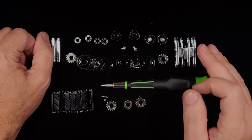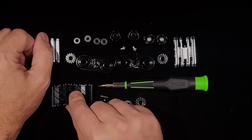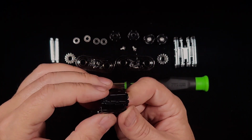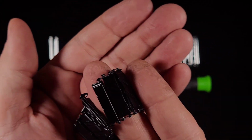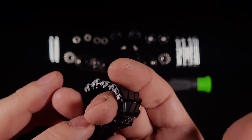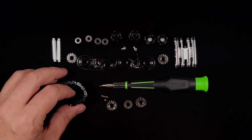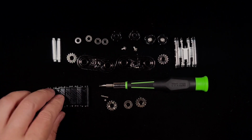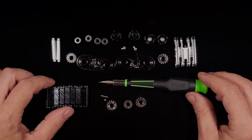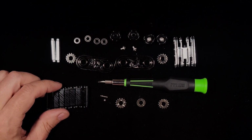But die casting can be done good and properly. I mean, this could have all worked out had they made these, maybe scaled this whole thing up a little bit if they had to, but these tiny little nail head pivot points on there are just too weak and brittle. The die cast, it's most likely zinc alloy, usually the cheap pot metal that stuff's made out of, and it's all soft and crumbly on the inside. It's not meant to take the force of things like snap pins being pushed on there.